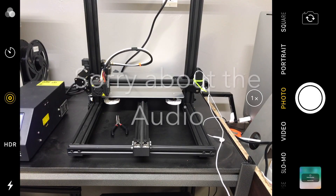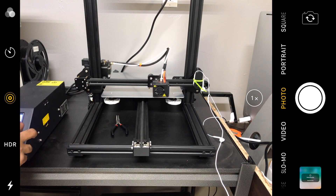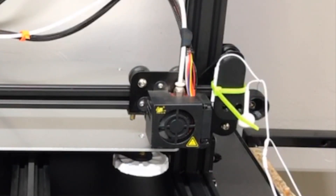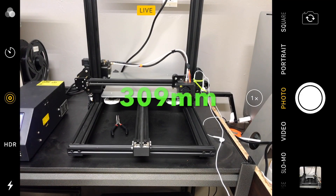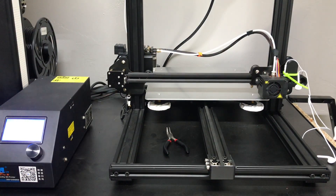Here I'm going to be in photo mode, but I'm recording my screen so you guys can see. Go down to Prepare, Move Axis, and click on Move X. I'm going to do 10 at a time. Now that I'm very close, I'll do one at a time. At 8, you notice my screen flashed — so it took a picture at 8. I'll go back to 7, then 8 again — took a picture. So now I know that my X-axis, in order to reach the button, is at 308.